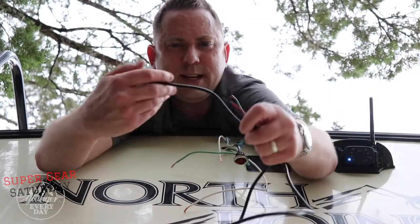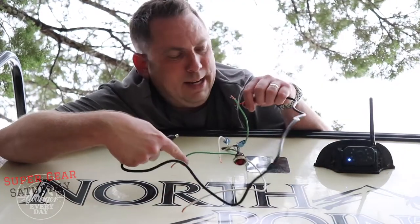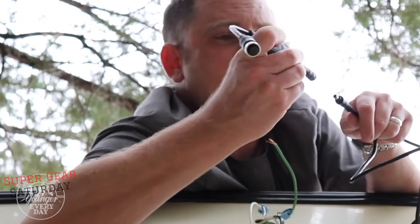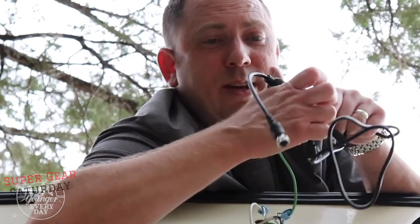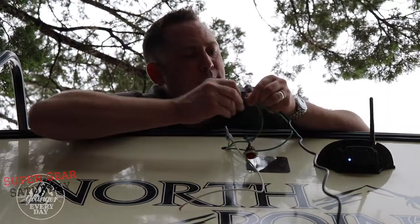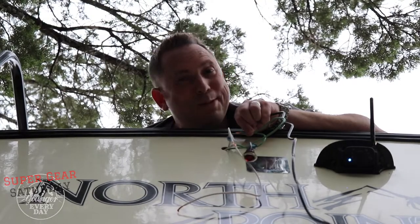Now I'm going to tie in the power cable with the red and black wire at the end since I know which one's hot. That cable will plug into my splitter. So we'll go power on one side, then one end goes to the camera itself, and the other end goes to my 39-foot cable going to the front to the signal transmitter. Just got to strip these wires — they're really tiny. I'm using wire nuts, which I know somebody's going to say don't do that, but sometimes you just do what you have on hand.